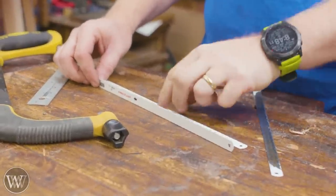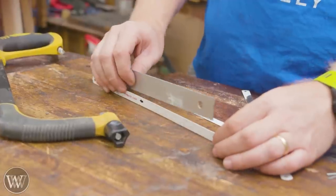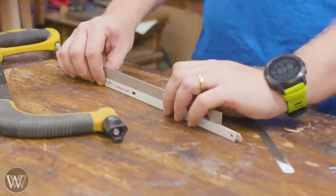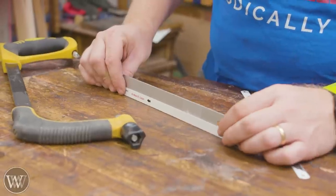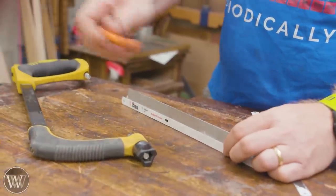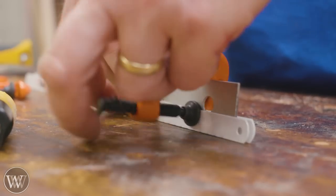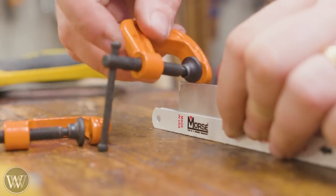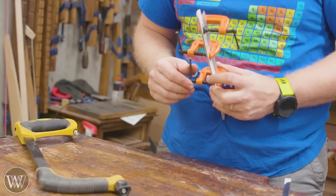Now let's move on to the teeth - this is the noisy and annoying part. I tried a bunch of different methods. I actually did a video on showing this with the split method of separating these, and I really like it - it works very well. I have since found a better method, but I'll leave a link to that down below. Basically we're taking the two plates, separating them - one upside down and one right side up - so that the one that's upside down will fit into the last slot, making sure you have even spacing between all the teeth. It is very important that the spacing between the teeth is exact. I like to come in and mark out where all the teeth are with the hacksaw. I got these little clamps that hold this down pretty well. This method works really well and gives you a very accurate depth of cut, which the other method doesn't. There are pros and cons to both, and links to the other method are in the description.